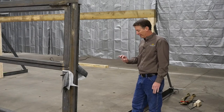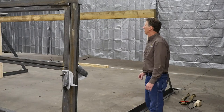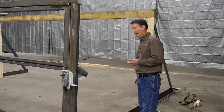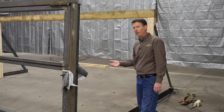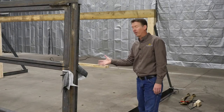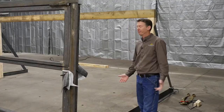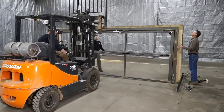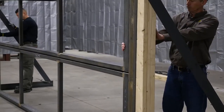Just keep that in mind when you're setting the door. We've had instances where that's been missed — flooring has gone in, the door got set, then flooring went in after, and now your gap under your door is a problem. At this point, you can take off the clamps or straps and drive it in and set it down.